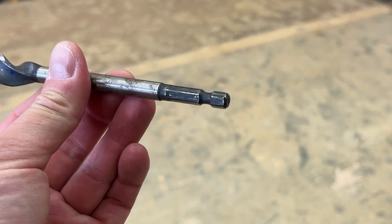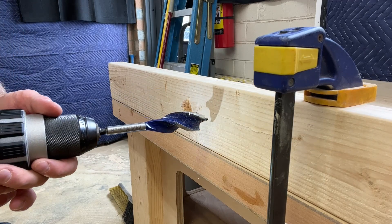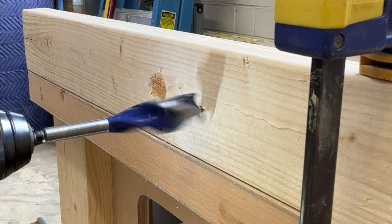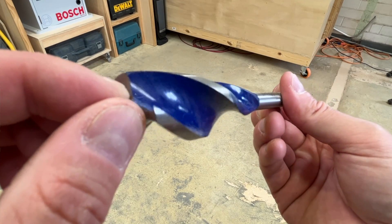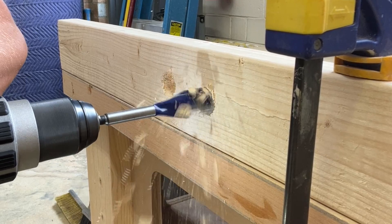Speedbores and other similar products require no pre-drilling — they'll clear a large diameter hole by themselves in seconds. They come with hex shanks that chuck into most any standard drill or driver. When you know your hole location, you just press the screw tip to your center point, fire up the drill, and provide a little force. Very quickly the screw tip engages, and it begins drawing the rest of the auger forward with the cutting spurs and lips shredding material in the cut path. The flutes are very wide and shallow, unlike traditional augers.